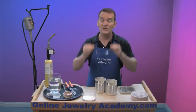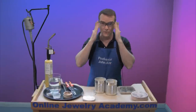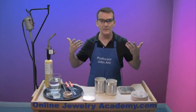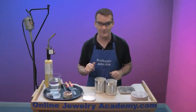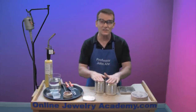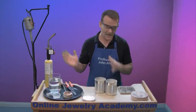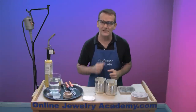Last but not least, don't forget your safety equipment. You want to protect your eyes and your clothing — you're working with molten metal. Notice I'm standing up. Never sit down when you work with molten metal; you might get it in your lap and that wouldn't be a good thing at all. Because this is so smoky, I don't want to do it in the studio here, so we're going to take this outside where there's lots of fresh air and we can get rid of the smoke really easily. Let me grab all these things and I'll meet you outside.